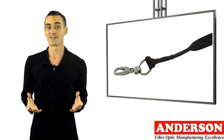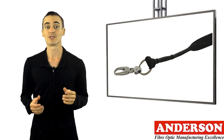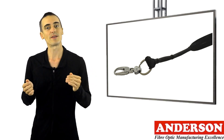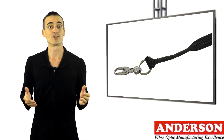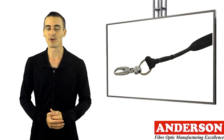How do you protect the connectors when pulling a pre-terminated cable? This is easy to answer. Make sure that you have a pulling eye or sock installed at one end of the cable. This will transfer the strain from the connector ends to the cable strength member and outer cable jacket, minimizing any damage. As a rule of thumb, if your cable is 50 meters or longer, then you should install a pulling eye at one end of your pre-terminated cable.